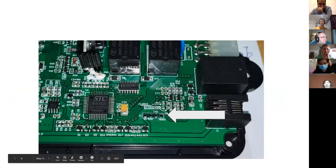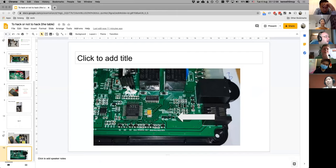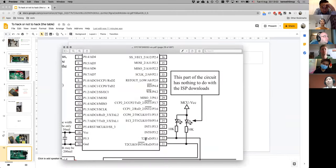When I was looking at the board, I saw a UART pin-out in the middle of the screen — it says 5V, RXD, TXD, and GND. This was way more interesting than just getting the motorized frame working. So I decided to wire it up, hook it up to my UART reader, and see what was going on. But it ended up with no data coming through at all, which was quite annoying.